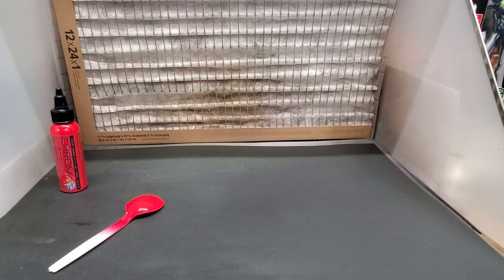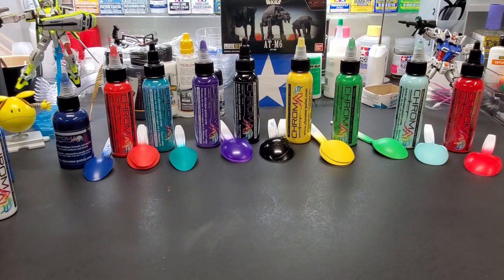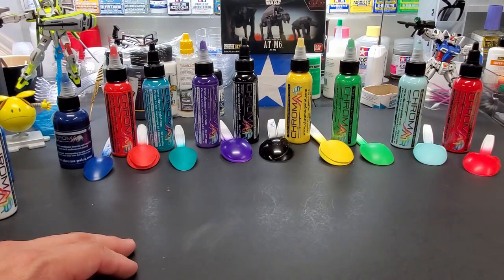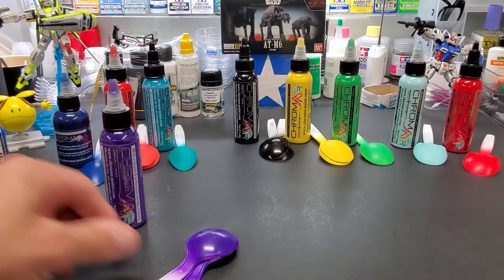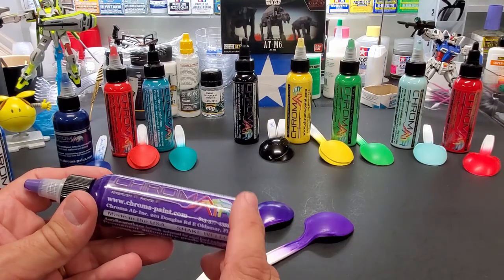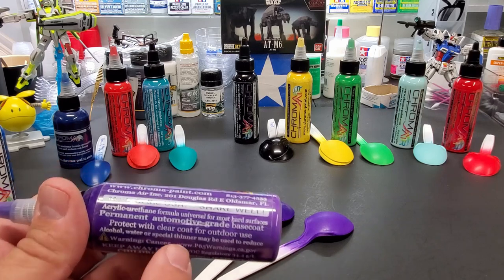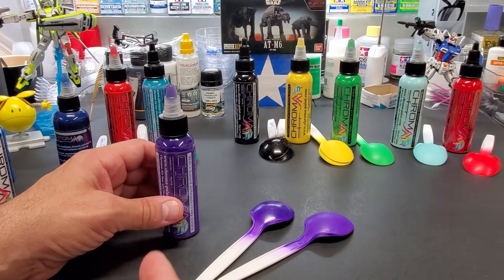I did a few colors off camera so I'll have even more colors to show than what we practiced here. Back at the bench and the results are good. Starting with the one we tried undiluted — it looked rough when I was painting it, but they said you can spray this from a 0.5mm or larger needle undiluted. I tried it — it struggled. Maybe I had to turn it past 30 PSI. But this is an automotive grade paint — when they say undiluted, it probably goes well in a spray gun at 0.7mm or larger.